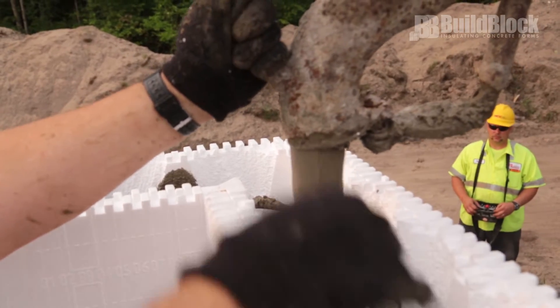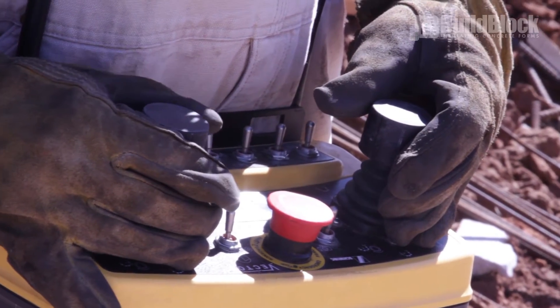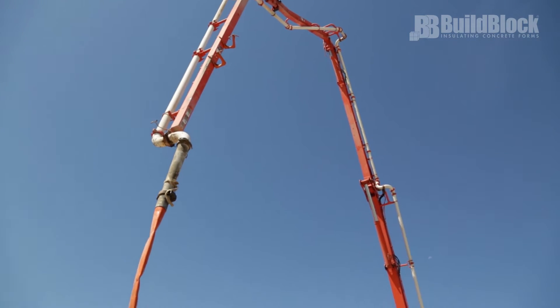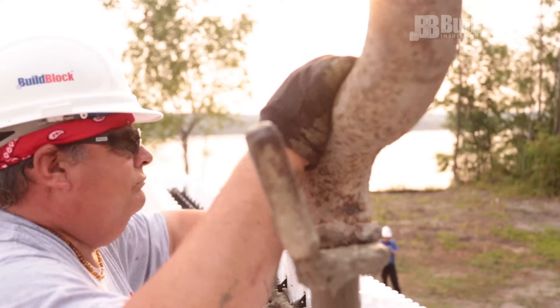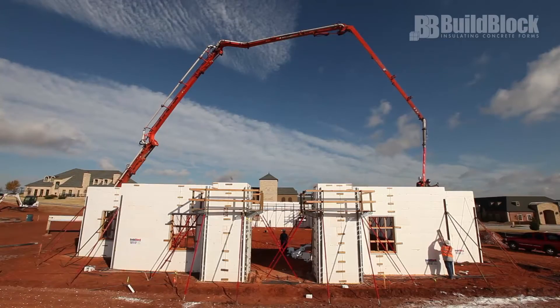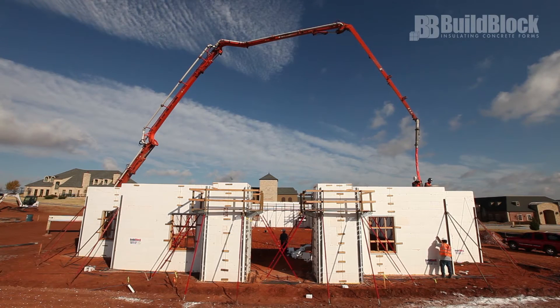Good communication is critical when pouring concrete. Work closely with the pump operator to pour smoothly. Discuss the type of pump and nozzle needed with the pumper before ordering. BuildBlock recommends a boom pump when pouring a full wall. Utilize a restrictor end, such as a double-L nozzle on your boom hose with a three-inch end maximum, to reduce concrete surge. Work in a dedicated direction, keeping in mind that a concrete pour should typically end where it began.